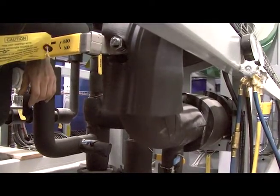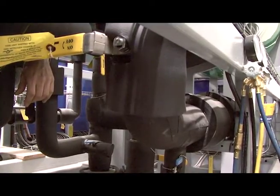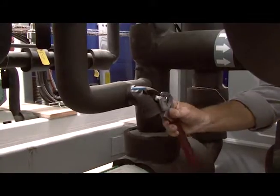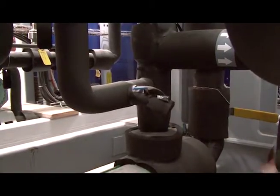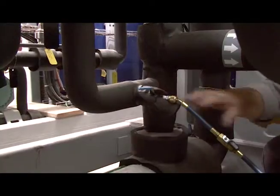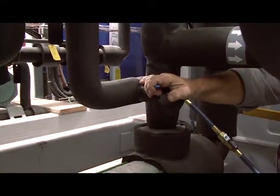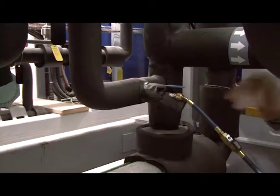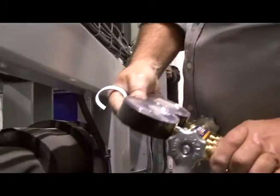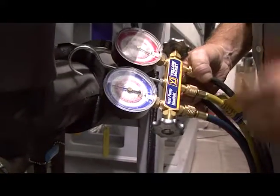Although we have CO2 in between those valves, we're going to begin to vent the system and start venting the liquid out so that we can begin to work on it. The first thing I want to do is get in here and remove the schrader cap. Once I get the schrader cap removed, I go ahead and hook my hoses up. I've got my hoses nice and tight, my suction manifold closed. Reach over and slowly open the quarter turn valve. Now I have it isolated, and as you can see on the gauges, we're running about 390 pounds of pressure inside the vessel or trapped inside our line.